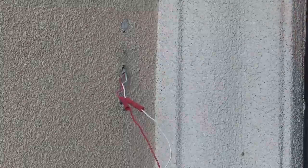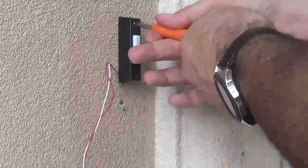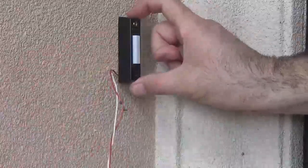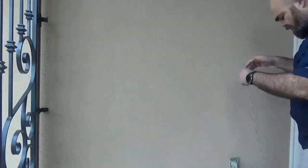Next, I'm going to insert red with red and white with white — I'll start off with the white. Since I'm going to put the old doorbell back anyway, I'll go ahead and install it now so I don't have to come back to it. Again, this is more for decoration because I didn't wire it — it's more so it can cover the crimping I did there. The next thing is to run enough cable to go where I need to go.